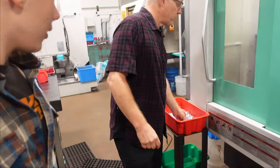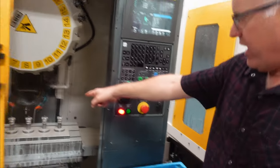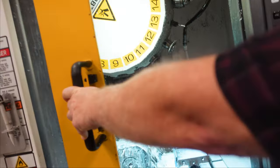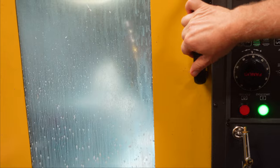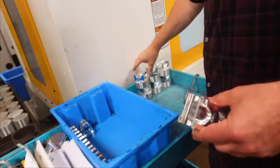You can see the pockets and splines on the side. All these machines have a water-soluble coolant that keeps them lubricated and cooled down. If you look in there you can see the tool moving around — this is making the hole pocket. You can see that coolant spray — that's what has to run on it so it doesn't break the tool. See how it's changing the tool there? That's doing the drilling operation for the stem bolts. After that it'll take another tool that does the tapping — the tap screws in and then reverses and screws out. So that part will look like that and then it'll be loaded into this machine and the final operation will be done.